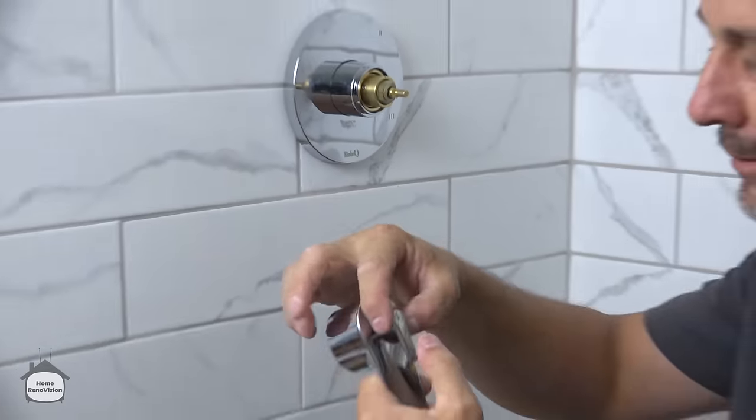And you'll see how quick and easy it is in ceramic. Now we're on 1 speed. We're not even using hammer drill here. Nice and easy. Done, nothing to it. What I wanna do is take my screw. It fits right in there like that. And I'm going to mount the bottom just as a test. Now, traditionally, the screws that they send you are only long enough to go into plugs. I suggest getting a longer screw.